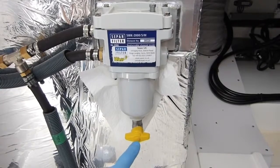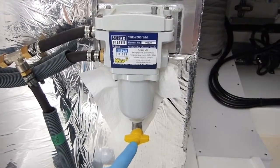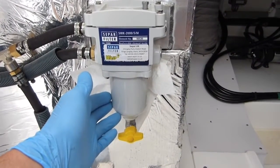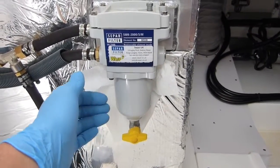On the bottom we've got a drain tap that allows us to sample the fuel and gives an early indication of any issues. Quite often on boats this part is clear, which allows us to see much earlier exactly what is going on so we don't have any issues.